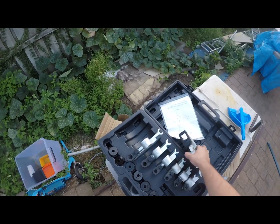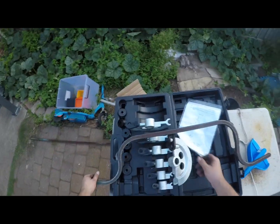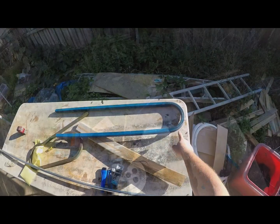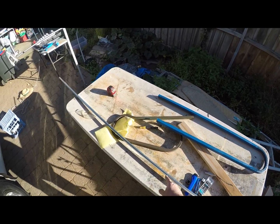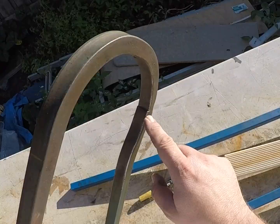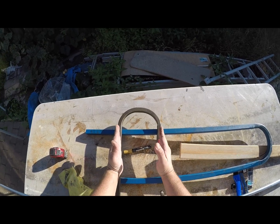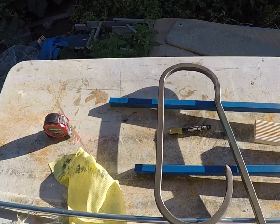I didn't try the tubes, and this one is actually bigger than 26mm. The curves — not much of an indentation on that side, small indentation on that side. So they're fairly neat. That's a 180-degree bend, but I was only able to do 150 and then I had to literally bend it on the floor to get the remainder. I could only go so far — this part of the bend was fine, but when I got to this point I was pushing up against the die. When I tried to bring it to 180, it kinked straight in.